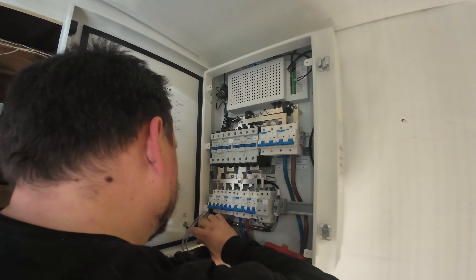If you're an installer getting stuck on the comms side, you just need to connect to the gateway and to the stack itself. Before we close the video, let's show you all the connectors. This is where all the cable and terminations are — we've dropped cables out of the wall here and will pop some silicon in to seal those holes. Your two sets of PV strings go into the inverter there. There's a little on/off button for the battery at the top. This is the comms plug — pins 12, 13, and 14 — for if you're using a separate meter rather than a gateway. If you're not running a data link cable, you'd connect those into your meter. We've got a direct LAN cable running off the second ethernet port back to the gateway, and it does all its comms through that. The ports are interchangeable — doesn't matter which one you use; it will link together and start talking. At the gateway side it's the same.